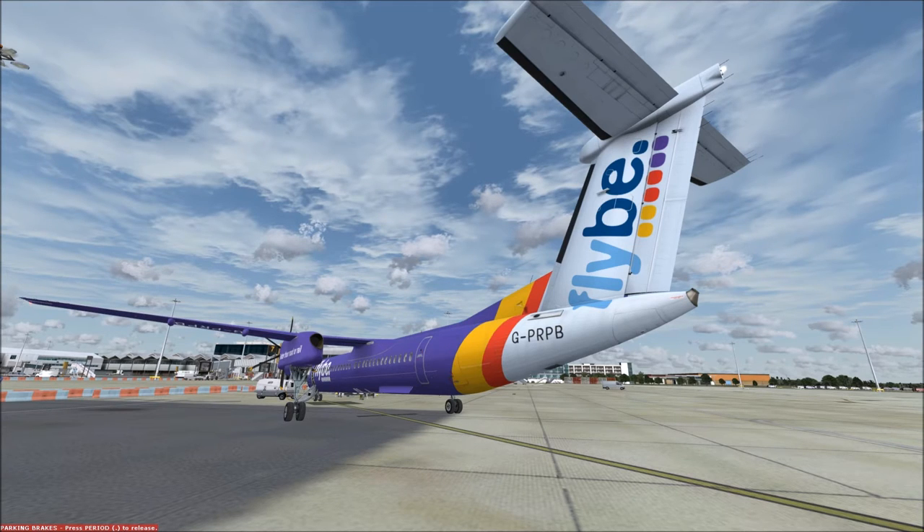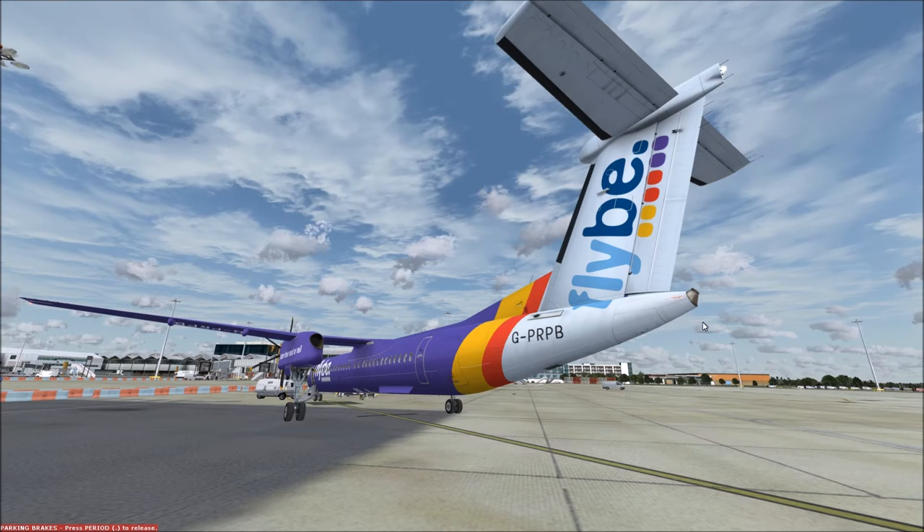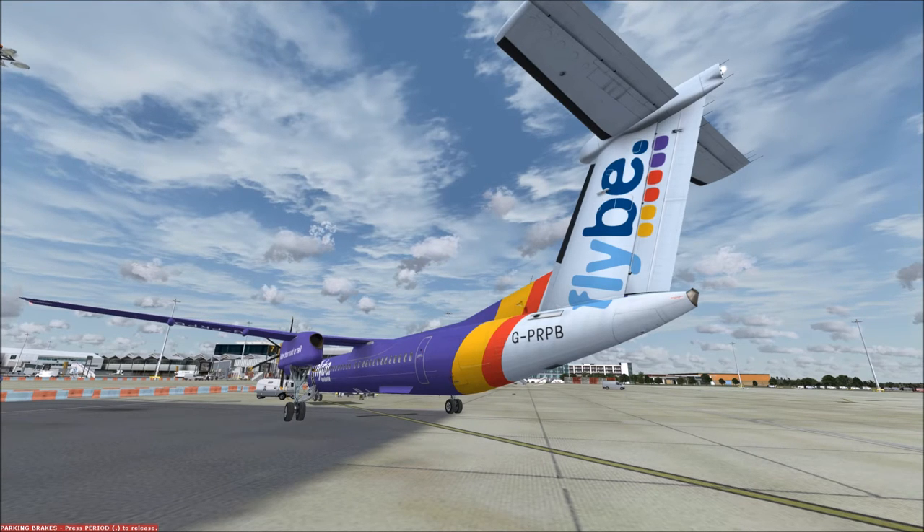It's a self-contained turbine generator located at the back of the fuselage. The exhaust you can see is protruding out of the rear of the fuselage here, under the tail section. It generates 28V DC electrical power for the DC system, and it also generates bleed air for the environmental control system on the ground. It's monitored by an Auxiliary Power Unit FADEC.